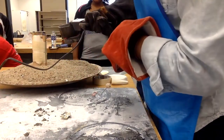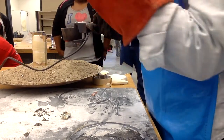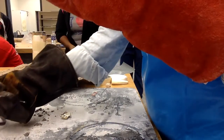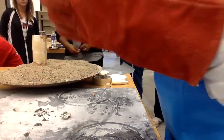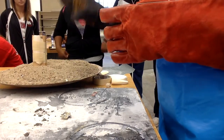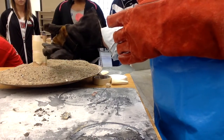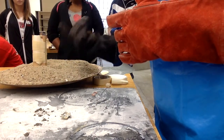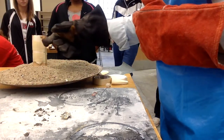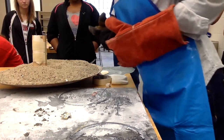It's running out — do you see how it's running out? That means it wasn't tight enough or wasn't sanded enough and there are too many gaps. If it doesn't work the first time, you wait until it cools; it's going to harden into a little puddle of pewter. Then you take it, get all the sand off, put it back in the pot, and melt it again. We've got to take this off and untape it.